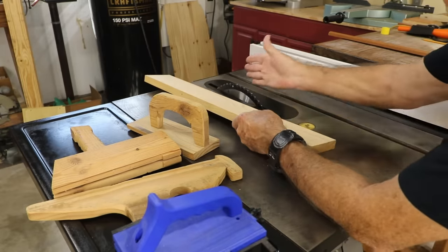I hope we've covered the dark side enough for you to understand. The dark side was: 50-something years ago we were told to put the blade as high as you can — or whatever you're most comfortable with — to get the best possible cut. The theory was that the blade coming down at more of an angle would give a better cut and go through the board better. It hasn't been talked about and nobody seems to want to discuss it — but I thought I'd just give it to you straight. It's not considered safe by today's standards, but it was done in the past.